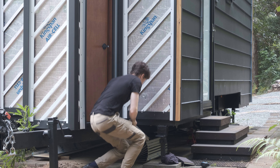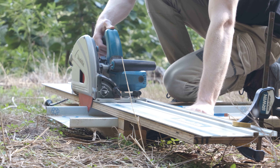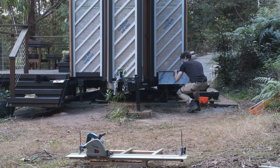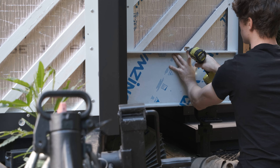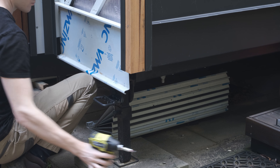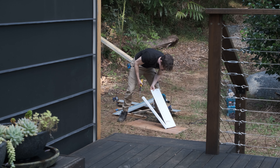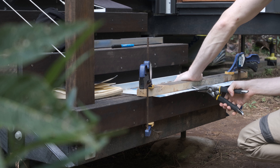For the most part putting the panels on is fairly easy but there are a few problem areas that will require a bit more work. With getting the panels on I also need to make sure the seams line up with the panels on the other walls and also across the box on the front of the house. The panels at the bottom of the wall are the most important as they really dictate whether everything after them is correct — there is some slight room for adjustment between each seam but it's easier to try and get things right here. These bottom panels need to be cut and folded into the bottom flashing. After cutting the panel to size I place it on the wall to mark out the fold, then remove the panel and cut off the bottom seam with my track saw, before folding and replacing it.